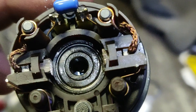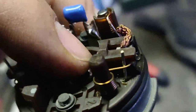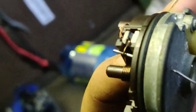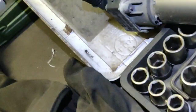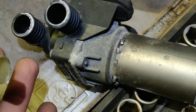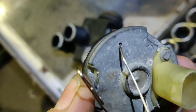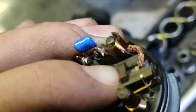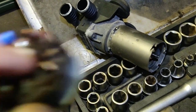The old ones are gonna push the new ones in and everything's gonna work fine. Put my finger in here to not lose the bushes. You need to drill two holes to hold the spring — as you can see, the spring is in here — because otherwise you cannot install the rotor, or you'd have to disassemble the pump, and disassembling it you can break these bolts off. So the best way is just drill these two holes, then pull these little pins out and the spring will go in and push the bushing into the rotor.